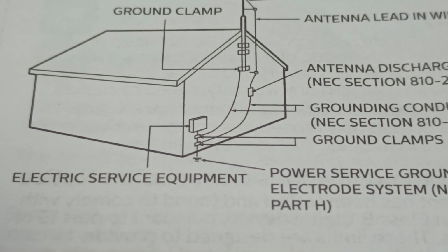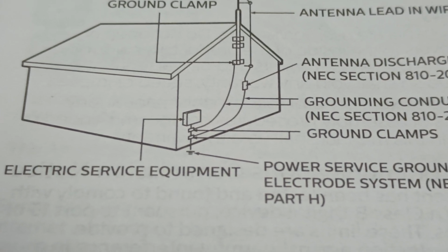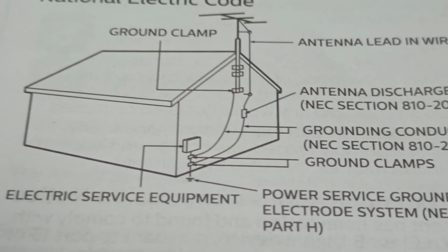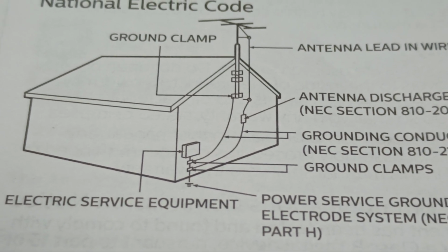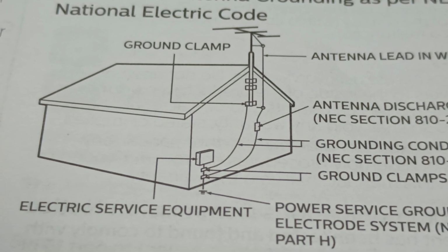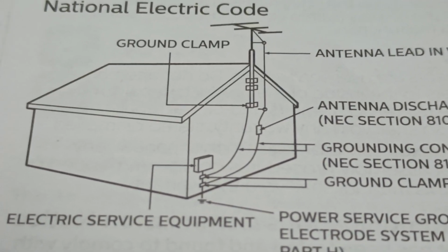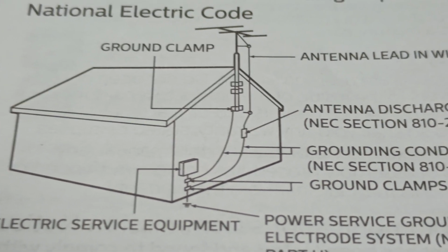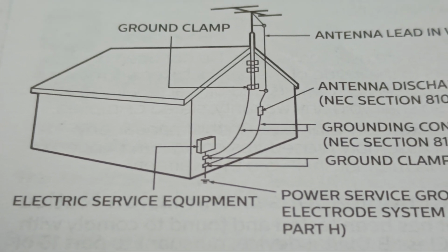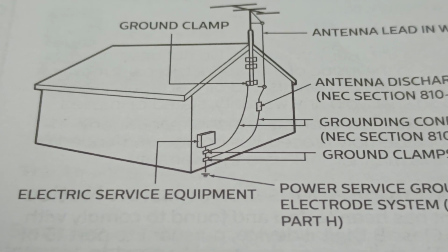That's why. There is way too much inductance in more than a few feet of anything short of a cable as big as your arm to pass lightning current without having a significant impedance. And notice the grounding experts on YouTube can't discuss any of this, especially the electrical considerations, because they know nothing about it. They're just repeating old myths from ham radio, and again, this is not a radio topic.